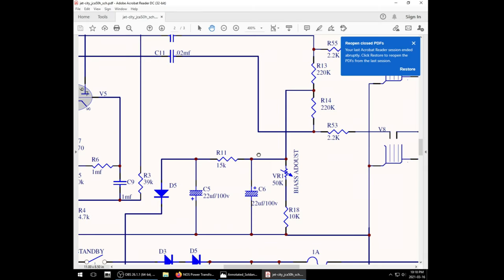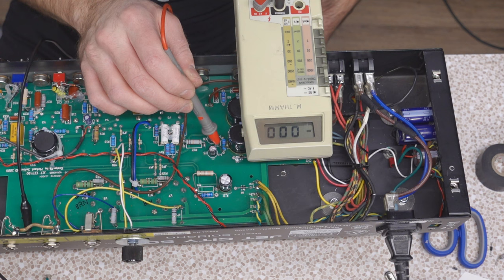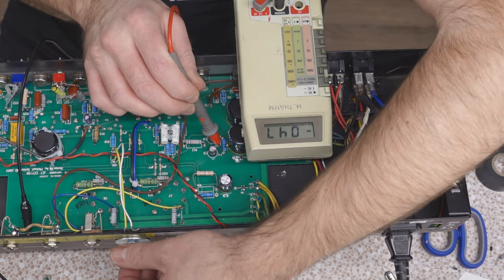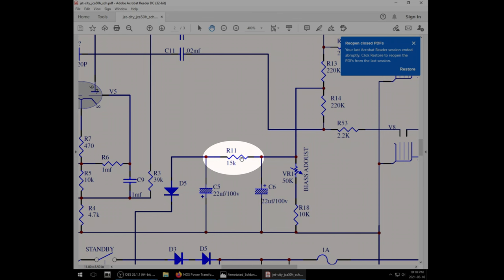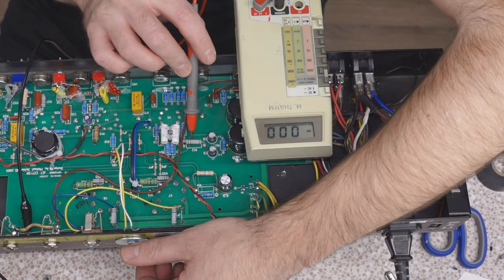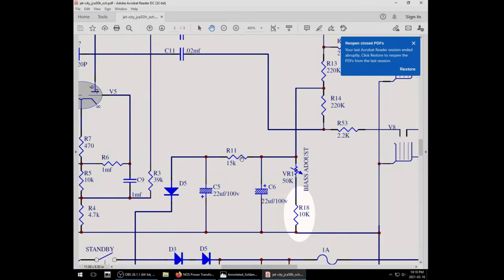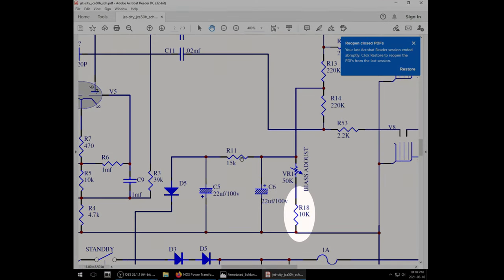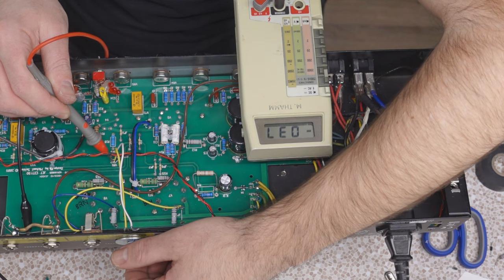All right, Jet City, bias voltage R11 right here. Negative 37, negative 47. We get 10 volt drop across R11, 15K. We might have to drop that value. This 10K transfers it over. No, that's not that 10K. R18, is there bleed to ground across that bias adjustment? Oh, I don't think that's gonna be enough bias voltage, bud.